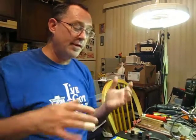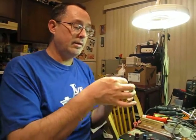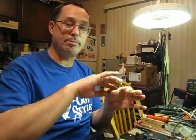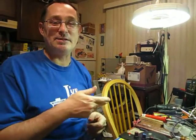They're really big chips. The thing about these toys is nowadays, the modern ones, they've taken those 3 chips, everything, and shrunk it down to a tiny little blob. It's a black blob. They've actually printed the circuit onto this chip and soldered it down onto this tiny board, and then there's a black epoxy. So it literally is a blob, and what comes out of there? 2 wires for the battery, 2 wires for the speaker, 2 wires for a button. So if you go to circuit bend that, you're either going to be activating the button, shorting the speaker, or blowing up the battery. Really not many exciting options.